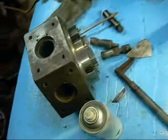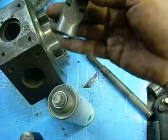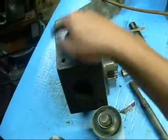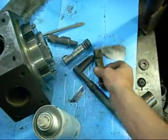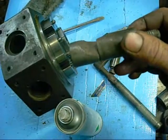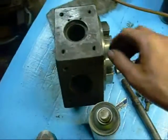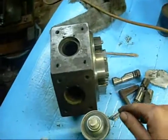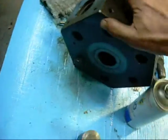I've just been giving the turret a bit of a once-over, cleaning everything up — going to take a bit of work. These are little clamps that hold the tool holders in place inside the sockets. You can also get bosses which bolt onto here, but none of them came with the lathe. That one here looks like it's home-made, it's just been ground out. I've only got four out of six, so I'll probably have to get bosses for the other two or three. Sometimes you have short tools and you'll need an extension, sometimes you have long tools and you can fit them inside in the mortise — I'll work that one out when I get to it.